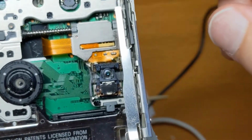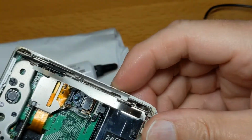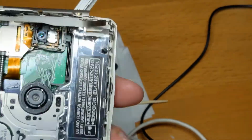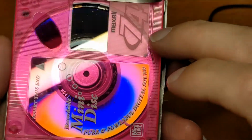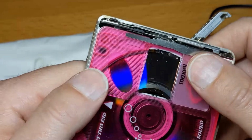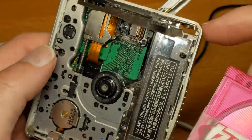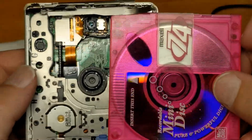Okay. Well, I wonder if this will play. I'm really nervous. I take the battery out. Now, if this is a recorder, the laser is capable of raising the surface of the disc in record mode up to several hundred degrees centigrade to allow it to be magnetically written. But this is just a player, so it's a low power laser, but it still scares the living daylights out of me. This is a good way to look at these. So don't do this with the battery in, okay? Otherwise, you might not even know you've damaged your eyes until days later.